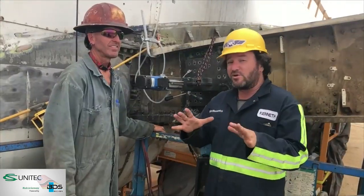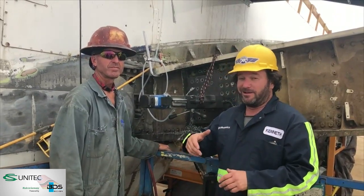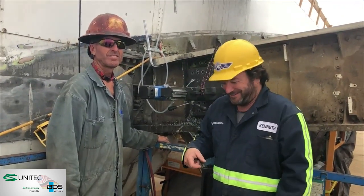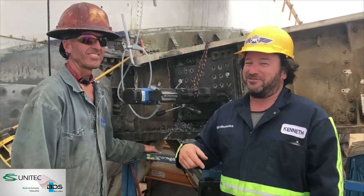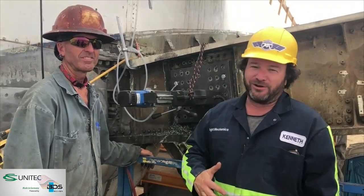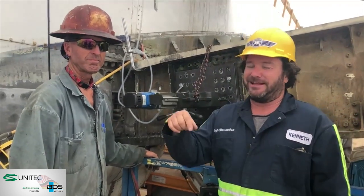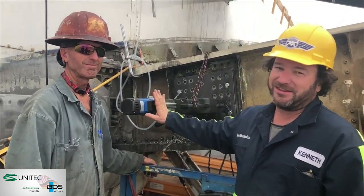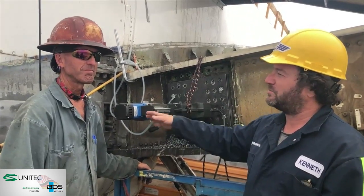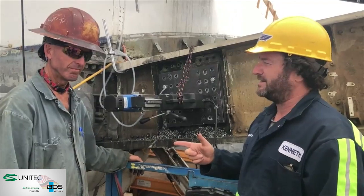When we first started the project, we did a test with a hand drill and tried to drill through this titanium — that didn't go anywhere. Then we tried one of our personal home hobby mag drills and that just didn't work either. So CS Unitec loaned us this. Getting the speed correct is very important when you're drilling through titanium.